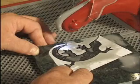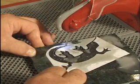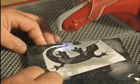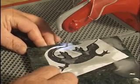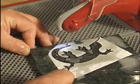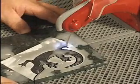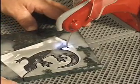The majority of the cutting with the Mega Blade is done with the front and back. You can use the blade sideways, but because it's so much thicker from the side than it is from the front, it cuts much slower. It's actually easier to turn the material around the blade to change direction. The advantage to the Mega Blade is the additional strength the teardrop shape provides, which makes it ideal for dense materials.